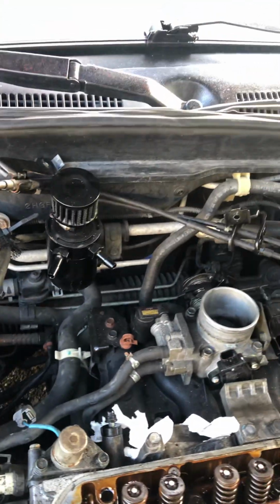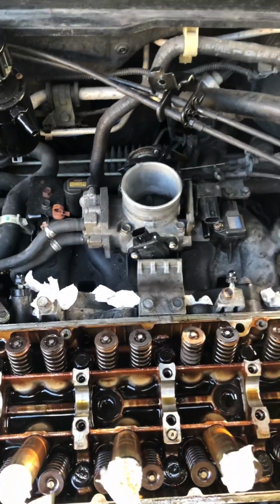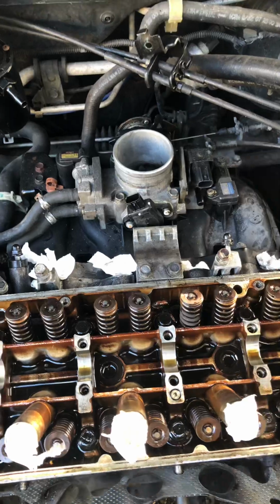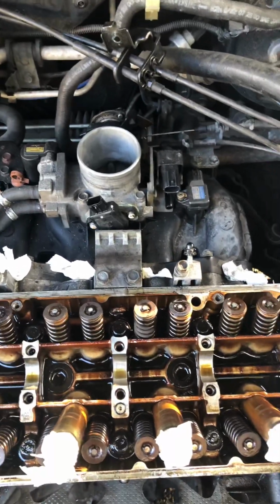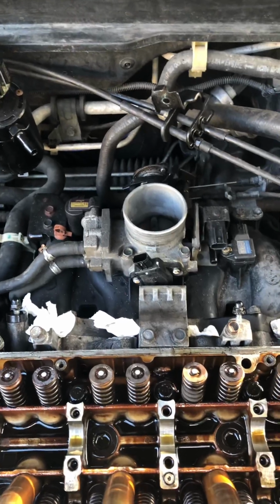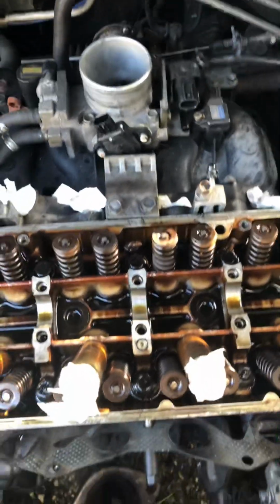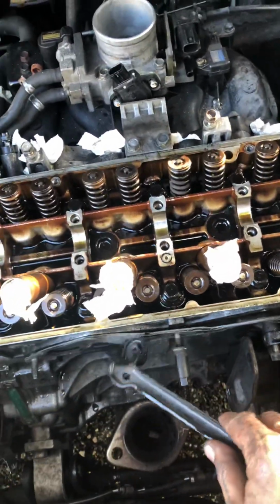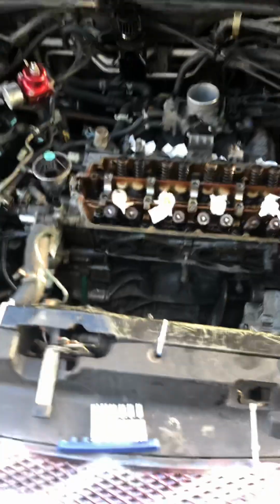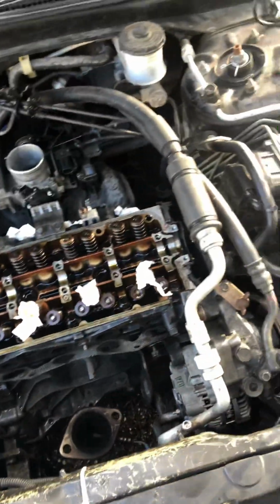Oil catch can is just gonna be here at the top. So I'm taking this manifold off because that plastic, with the horsepower that I'm gonna be boosting, is gonna blow out of that gasket. That's gonna go whoop, boof, and blow out. So I'm gonna change that out to the Y8. I was gonna case swap, but I'm gonna keep it simple and do what I was gonna do with the top mount turbo that goes up here.